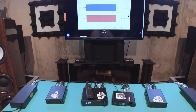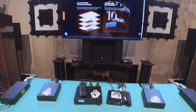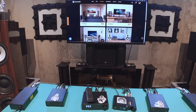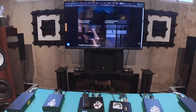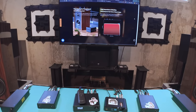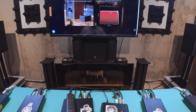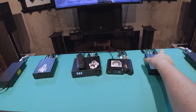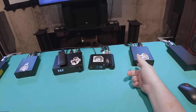They're advertising 240W. You've got all sorts of things in here — op-amps, 10-minute shutoff timer, cooling solution — they're really nice, whoever's doing their page layout is really really good. They're showing home theaters with like five of them on the rack. Load dependence defeating — overcoming the pain point of Class D amplifiers — reduces output filter impact, boosts frequency response for balanced natural tones ensuring true reproduction. For 8-ohm loads you can see the spikes starting to go up, that's why we don't plug headphones into these anymore. Golden Sound was nice enough to do the research into what happens when you plug a 150-ohm load into a Class D — and it's not pretty.